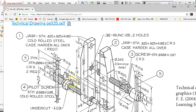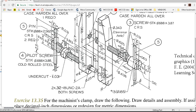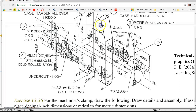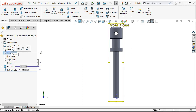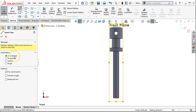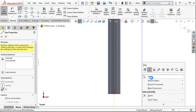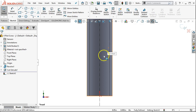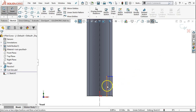An eighth of an inch undercut, 0.031. So 0.25 by 5/16ths. I'm going to use the revolve again — front plane, sketch, center line, vertical, infinite length. That sets up all the preferred conditions for my revolve. Since we have a gap in the cut revolve, we're going to need that center line for our geometry.